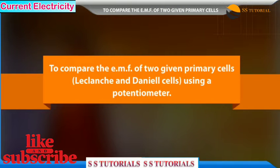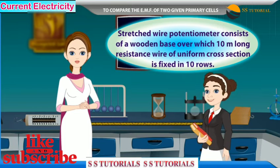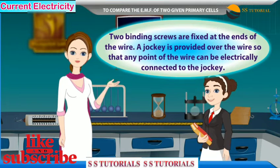To compare the EMFs of two given primary cells, Leclanché and Daniell cells, using a potentiometer. A stretched wire potentiometer consists of a wooden base over which a 10-meter long resistance wire of uniform cross-section is fixed in 10 rows. Two binding screws are fixed at the ends of the wire.